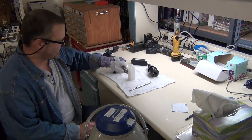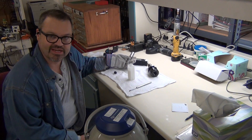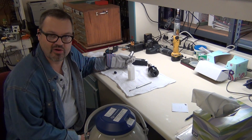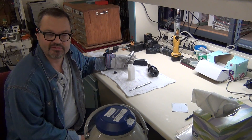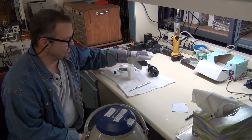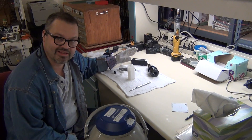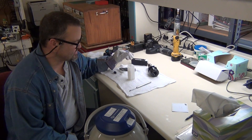We've got a one-inch ball end mill that is a Weldon shank, and I suspect it's out of spec. When we mic it, it measures 0.9999 to 1.0000 in some places. Weldon shank is supposed to be at least one ten-thousandth under an inch, but as much as five ten-thousandths under. This one's about exactly one ten-thousandth and we can't get it to fit into any of the one-inch tool holders here. Most end mills don't have a problem — this one, I think, is made in China. It's probably technically in spec, but it's right on the high end of the spec, so it either needs some force or something to get in there.